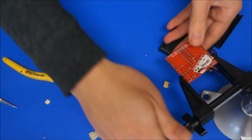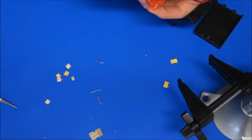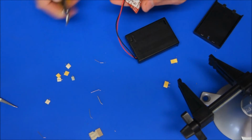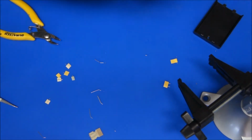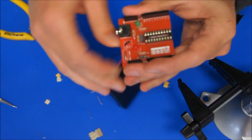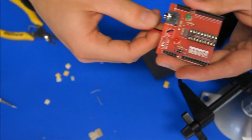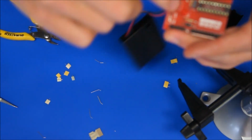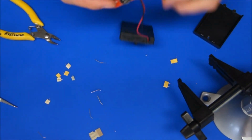Wires are the only thing that I don't cut first, so any wire I solder in place because it's a bit hard to semi-clinch, and then cut it off afterwards. And once I've soldered it in place, I can just pull those two leads all the way down so they're nice and flat, and that hole there takes the stress of me tugging on that lead rather than those two joints, which is good.